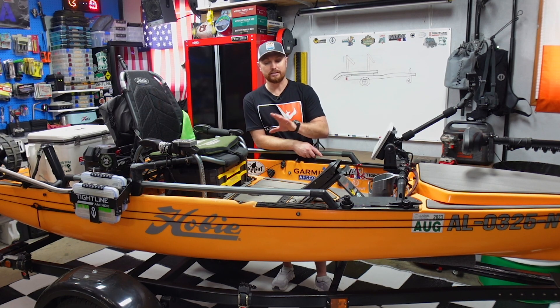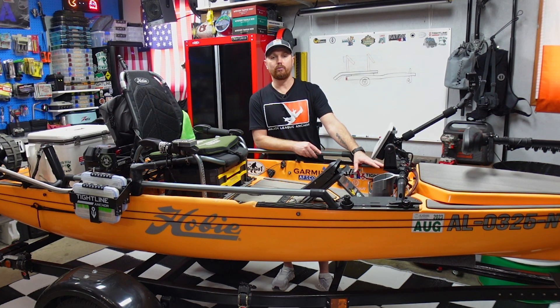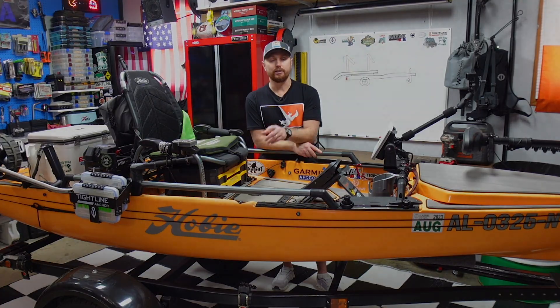Today I'm going to show you how I go about locating where I want to put my ports in my boat, how I run my wires, and we're going to tie it into my Yak Power system that's already installed. I'll be able to push a switch and turn the power on to that port. If I'm not running the camera, I can turn it off at the Yak Power system.